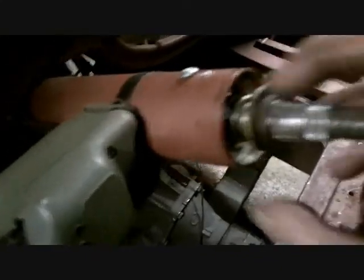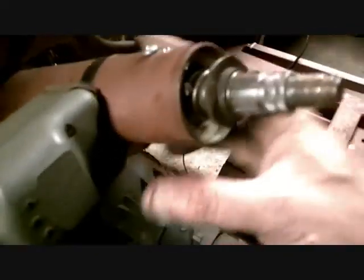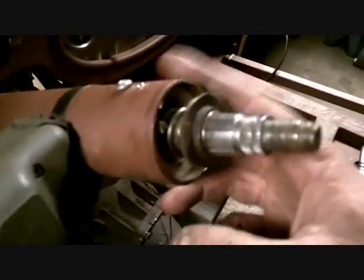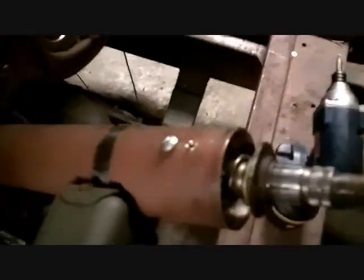Well, here's one for the record books. Now, Dad had machined down a nylon collar that goes inside. I think it was original GM, and he machined it down to fit inside the 2-inch. This is stainless steel that he had next to his lathe. And what we did is we had drilled a hole just before the bushing so the bushing wouldn't sink all the way in. Well, with the new wheel, we didn't need a collar if I could move it down just, not even 3/8 of an inch.